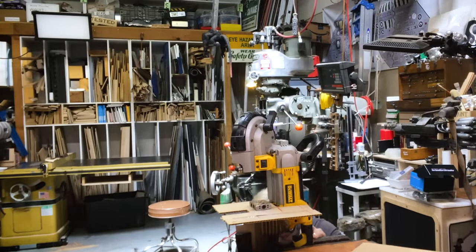Okay, now all I need to do is connect these up to two of the connectors on the switch. This is what's called a double pole, double throw. So the way this switch works is either I'm connecting this connector to here, or when I move the switch this way, I'm connecting these two and these two, but on two separate channels. So I can power two totally different machines using totally different amounts of power between this one switch.